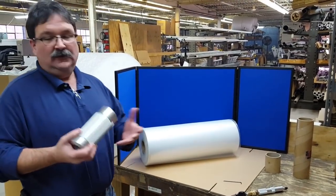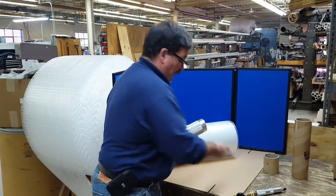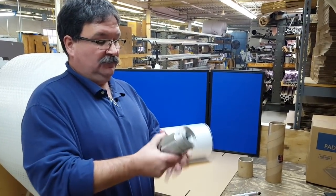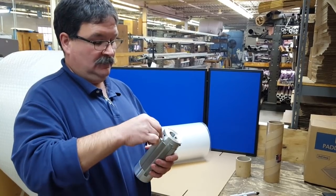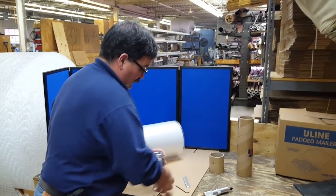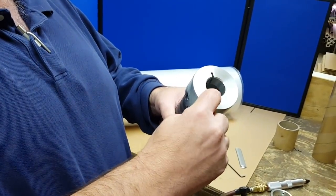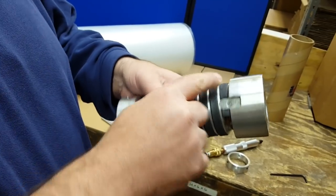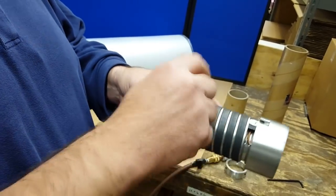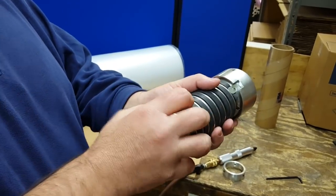All of CAC's CoreLock products are manufactured here in Wind Gap, Pennsylvania, so everything is manufactured in the United States. Inside the chuck there is a rubber tubing. To pull this apart — if you ever need to replace the rubber tubing — you simply remove three set screws and the end cap pulls off. You can then remove the segments. The internal construction is simple: there's an air valve; the air travels through the valve, through the copper extension, into the rubber tubing. A clamp holds the rubber tubing onto the copper, and on the other end there's simply a rubber plug. When air pressure is applied, the rubber tubing expands, and that's what pushes out the aluminum segments, which fit loosely together on the chuck.